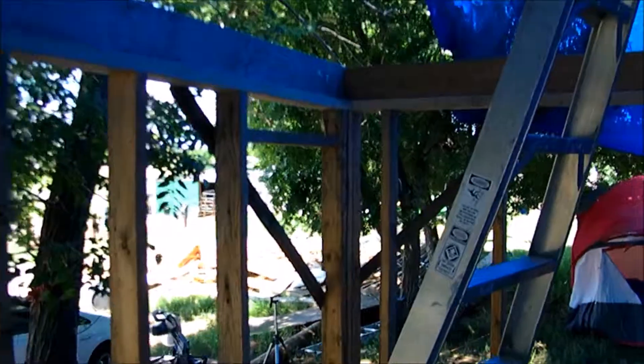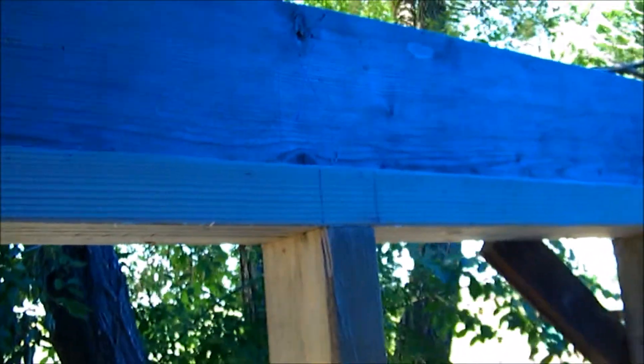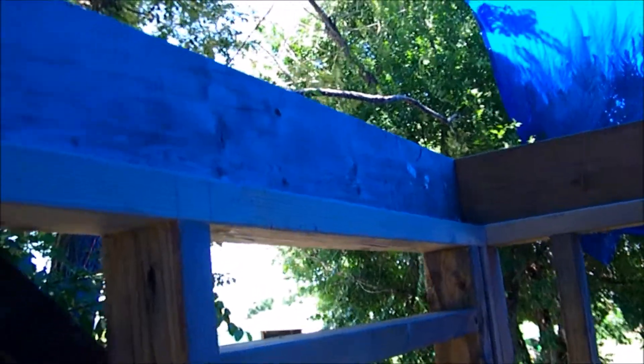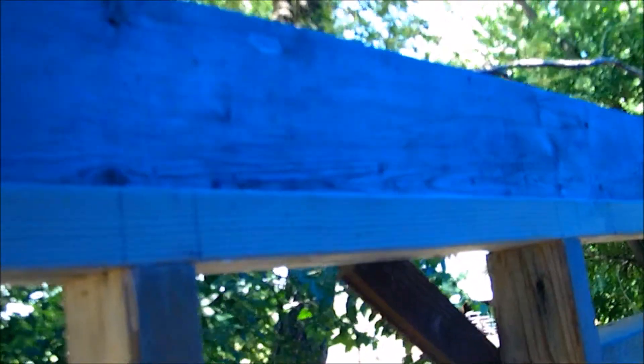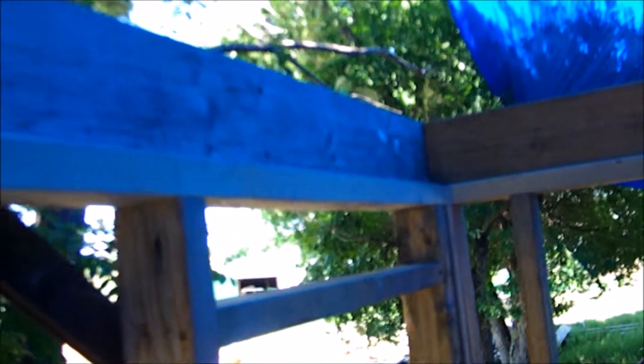This is going to be similar to what you would do in framing the wall — you're going to lay out the same dimensions on each side, marking where each joist is supposed to go, and take the twists out by holding it down with a metal clamp, like we showed in the framing video. Each of these is going to be 99 inches. The rim joist was a really nice idea we got from another YouTuber who was doing a SketchUp design. It's a great way to get a solid resting place for the loft joists, and the loft joists in turn firm everything up.